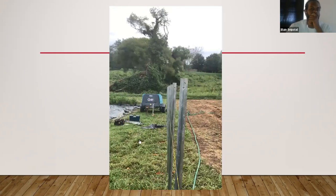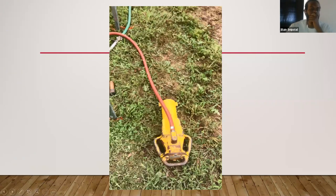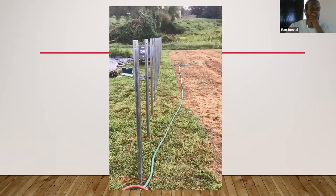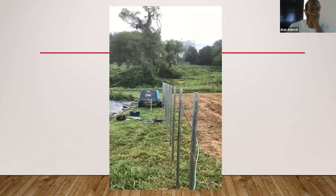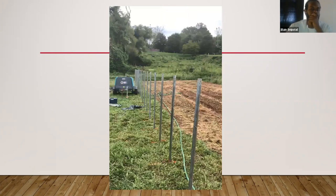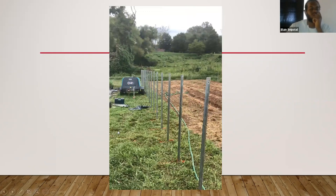In our case, we only used a sledgehammer for years. And then we discovered this pneumatic post driver for a few hundred extra bucks. It makes our job far easier. We can get this done in terms of posting the ground and squaring in a matter of maybe 4 to 5 hours at most, versus you sledge this thing in by hand.